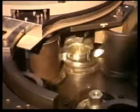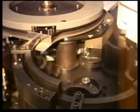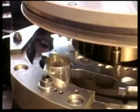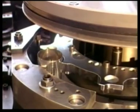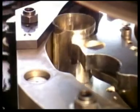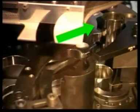Following parting, the can bodies are separated and enter the transfer zone, from where they are transported to the following module at the same level. In our system, after parting, the upper can body is pushed outwards and additionally fixed. Even can bodies with powder-coated weld seams can be parted reliably and easily.